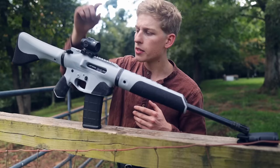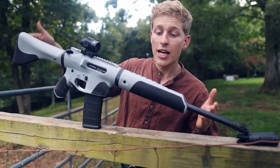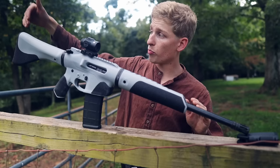And that's really it. So most of these parts are indeed 3D printed, and that does bring the cost of the gun down. It doesn't really make it much lighter, a little bit lighter, because the plastic in the end is actually pretty heavy. The plastic components are around 2 pounds or 900 grams, so almost one entire roll of Polymaker PLA Pro was used to print this gun, and I didn't use 100% infill everywhere.